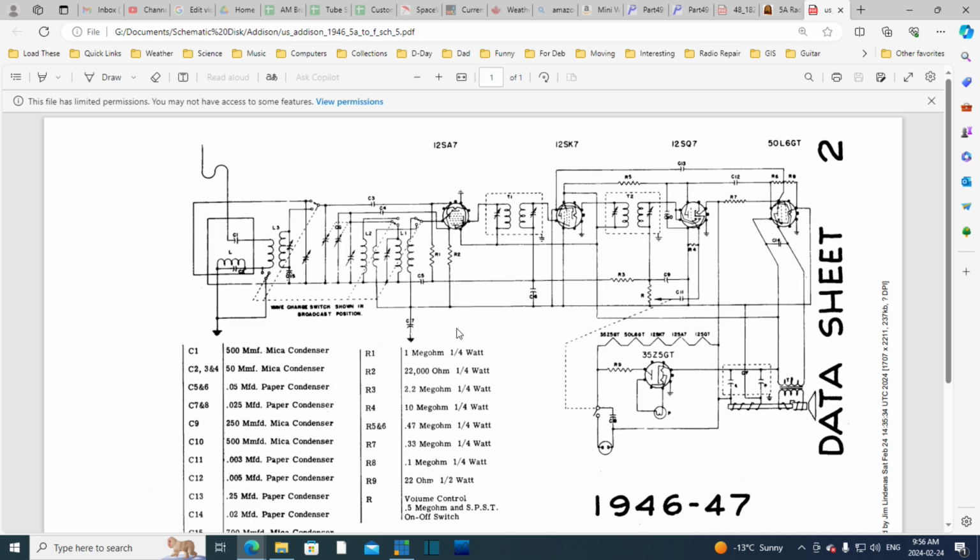You've probably experienced this, and maybe if you've worked on these radios, you've probably experienced what I would call a brush shock, where you brush up against something and you get a bit of a shock, or a tingle shock. I think sometimes that's the term that's used for it. So this is a safety deal. You need to hook the chassis back. This is the safest way to do it. Now, a lot of these have a resistor, like maybe 150,000 ohm resistor in parallel. This one doesn't. Now this capacitor is doing something similar.